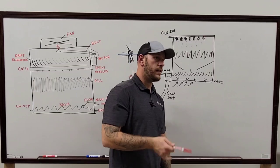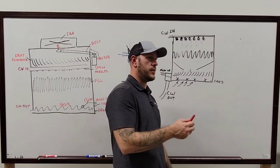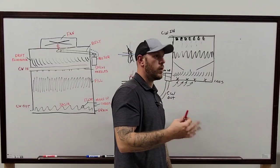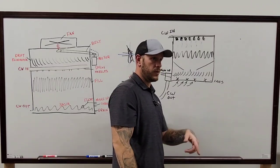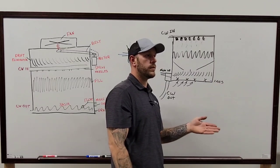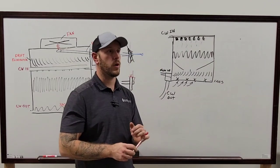Yeah. The more you have on that pulley, the better off you're going to be because then on whatever angle you're looking at that pulley, you won't miss it when you start to spin it. When you start to spin that pulley around is whenever you're going to start noticing how it's walking back and forth. And that's usually what we're referring to with walking.